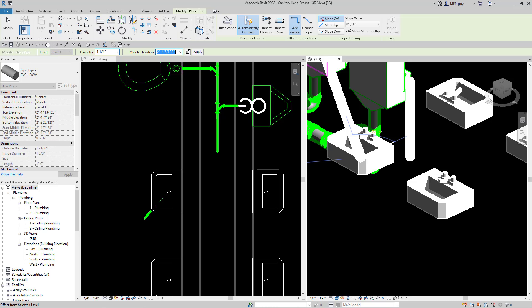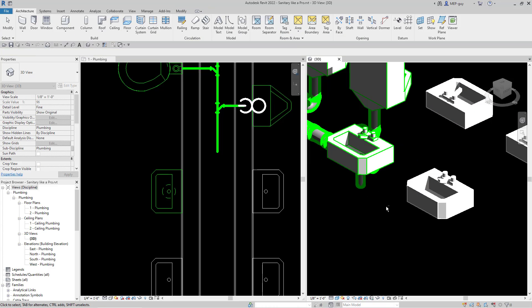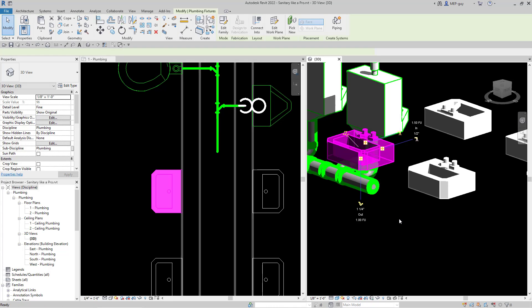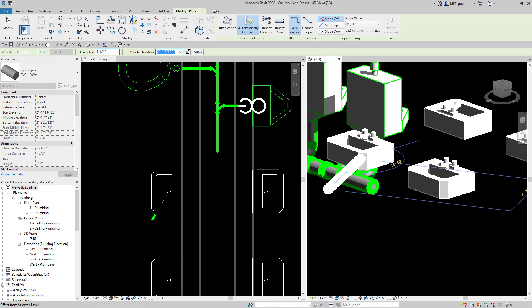Here's a pretty ninja trick: if you want to drop it down to say one foot six, you can type one space six, and that's actually one foot six — you don't have to enter those foot and inch markers. Hit apply and Revit drops that piece of pipe down. Another cool way: select the lavatory, click the create pipe button, and if I want 18 inches, just type zero space 18. That will also work — it'll be one foot six because it's 18 inches.